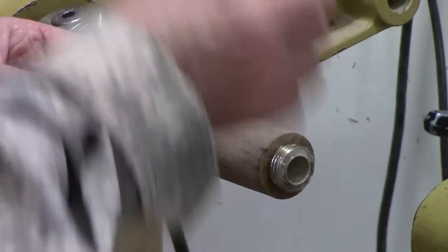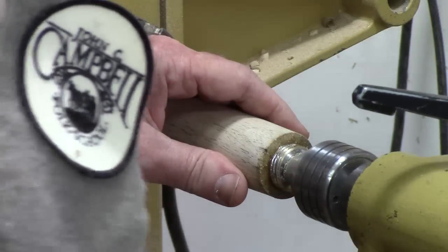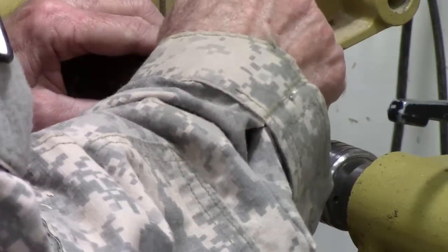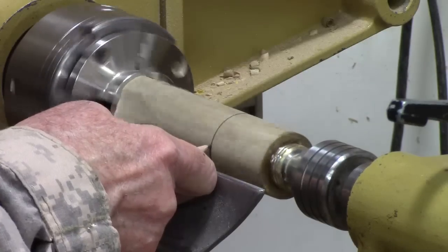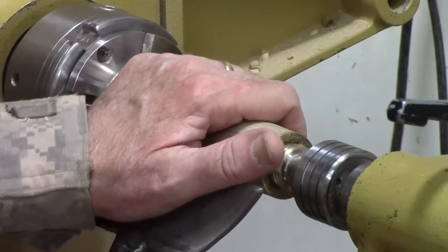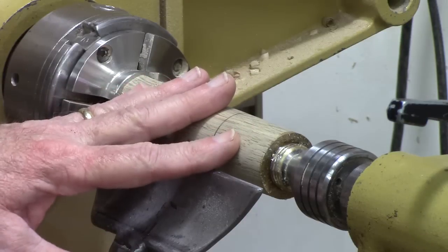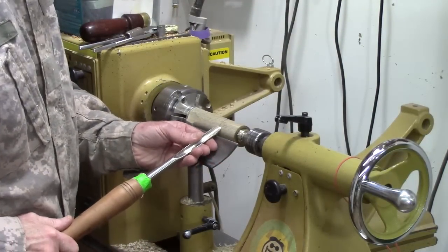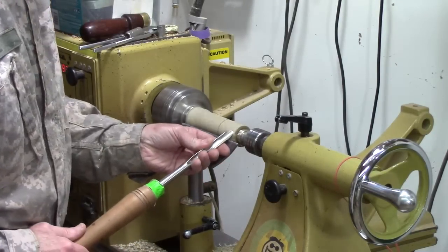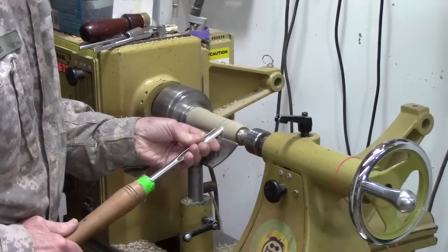We're going to glue this holder in later, so we're going to use a 90-degree cone to help keep this running true. I'm going to look at the shape of my other screwdriver — it's going to be a little bit smaller right there. How you shape it is certainly up to you. I would make the handle fairly thick so you can get a lot of leverage and torque when you're using it. I wouldn't get too crazy with convoluted beads and coves — just make yourself a good comfortable handle. So I'm going to use a spindle gouge, taking it from here, blending it down with a fairly straight line to the bottom of the ferrule.